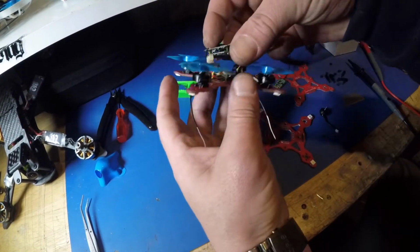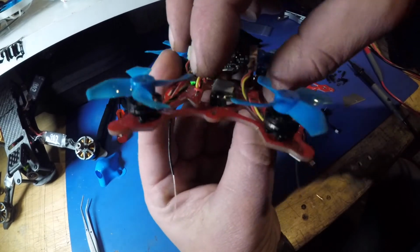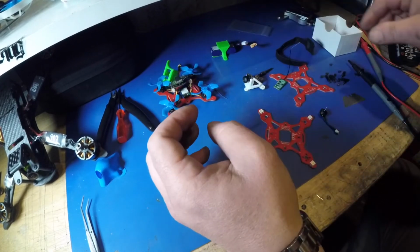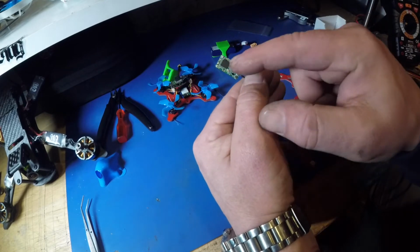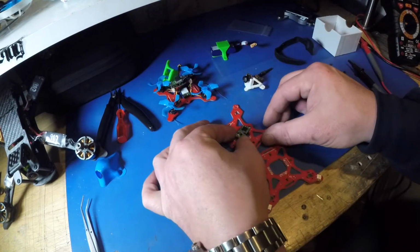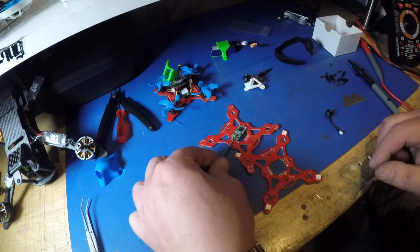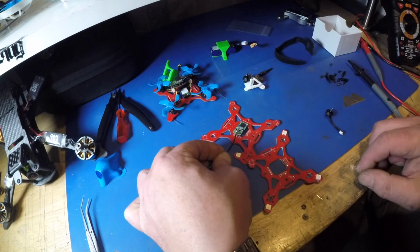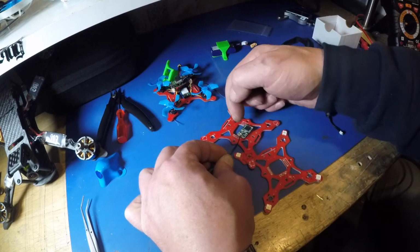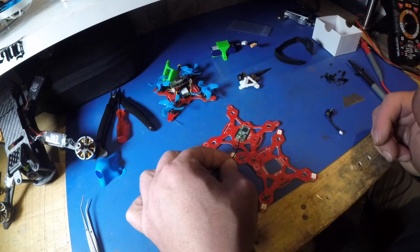Right, I've covered that, so you can see up under there how I've mounted it. I put the pin headers in, soldered them down. There we go. Board onto that. Now if you are like me and your RX had cable attached, just desolder, and then if you hold over the pins, if you've got your pins in it and you hold them over like that, just apply a little bit of force and run your soldering iron up and down, it should sink down onto the pins. Take into mind that you might have to apply a little bit of electrical tape or something at this end of your RX just to stop it touching on the pads this end. If it clears, it might not give you that hassle.